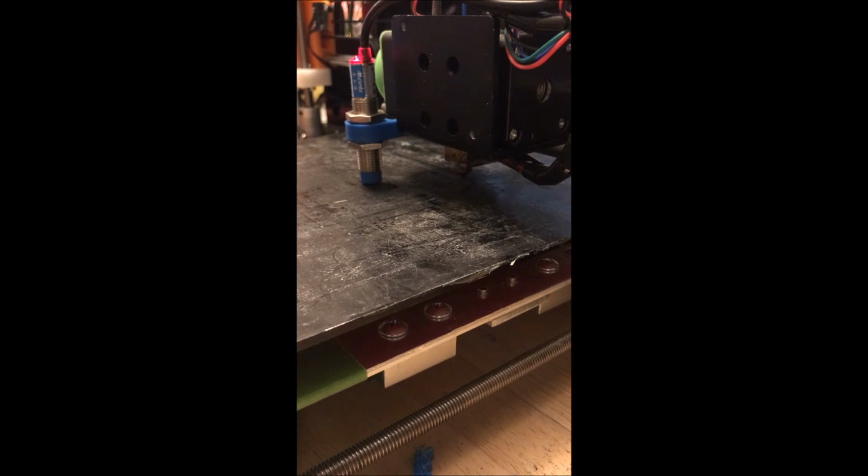I actually have decoupled the x-axis from the z to prevent layer shifting. As the z-axis travels up and down, there's just a tiny little bit of side-to-side movement sometimes in the bars, and this way everything stays completely set by the linear slides in the vertical direction, and these stay nice and smooth on that. They do have printed versions on Thingiverse that work well. My printer was not working when I got it going, so I machined those out of Delrin or acetal.